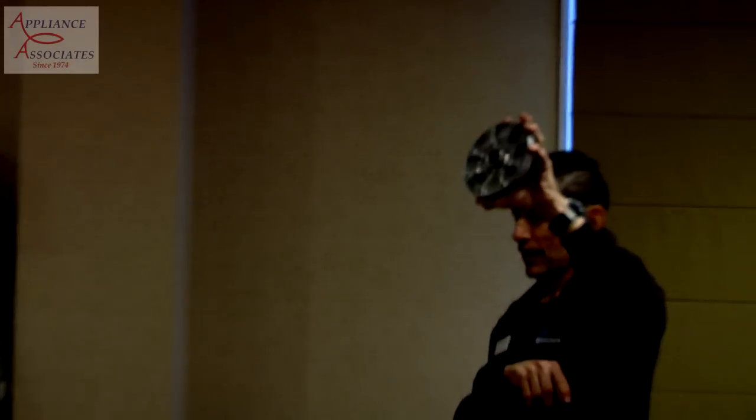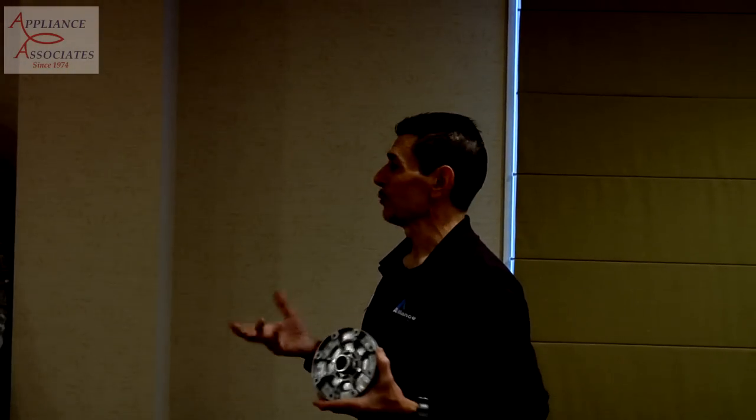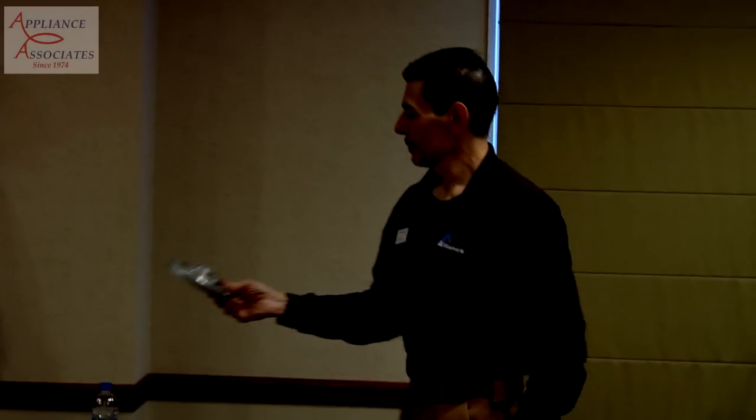Important here. If you do not lubricate this a little bit, you're going to have a problem with burning the seal. Okay, so I've heard instances where they've replaced these, didn't put the lubricant on, it comes in a kit, and then a couple of days later when the machine is run several times, you usually smell burning rubber, and then this seal will start to leak. The seal is mounted on the inside of the outer tub.